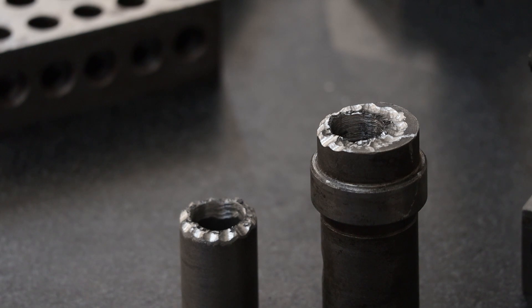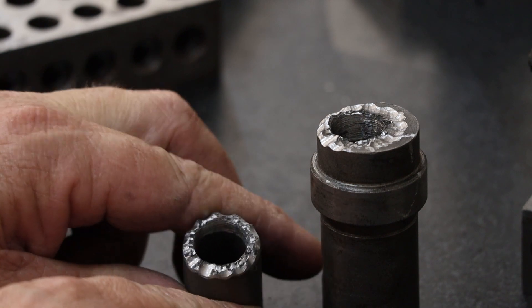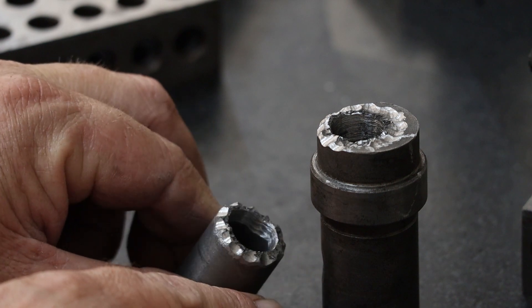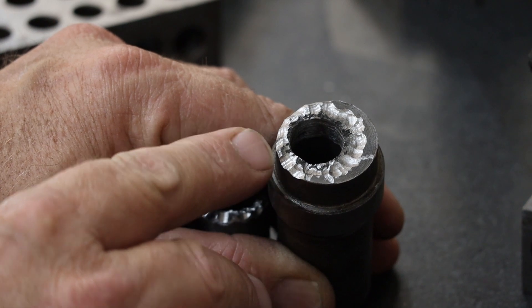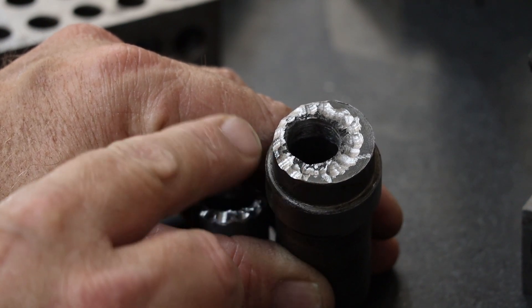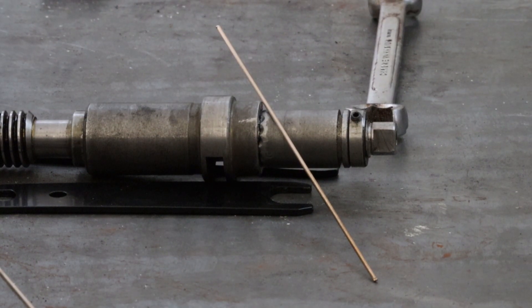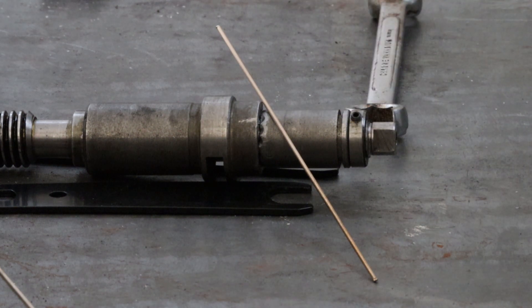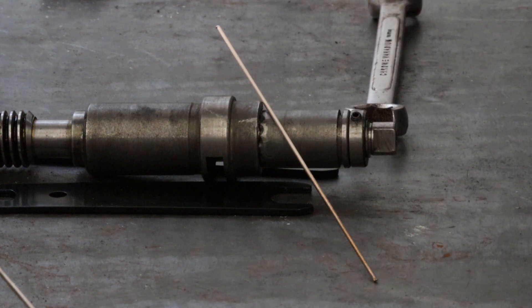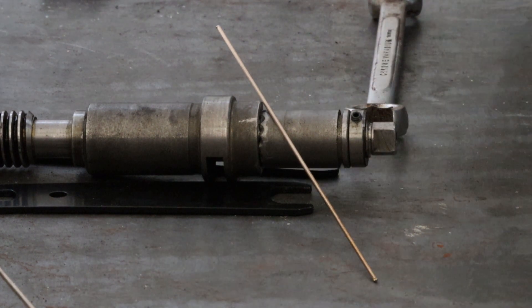In preparation for welding these parts together, I've ground away most of the raw material and left a jagged surface to bond to. I've exposed metal and cleaned the parts with acetone. I've got my silicon bronze wire cleaned off and I'm ready to tack this in place. I'm using the support ring and the existing rod to pull it all together.